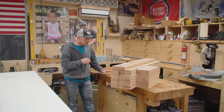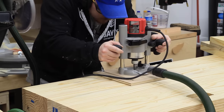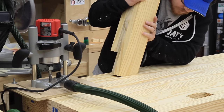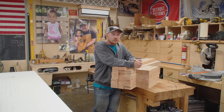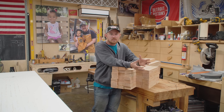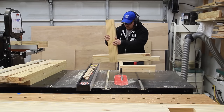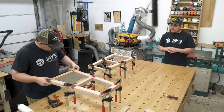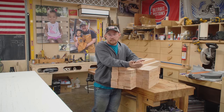This workbench I'm standing next to was built in 2016 — seven years ago. I went through the process of making a mortise and tenon joint from the legs to the bottom of the top, and I'm very happy with how that turned out. I did not want to do that eight more times for the rail-to-leg connections, so I used a massive half lap joint instead, which is plenty strong enough. Half lap joints are the very first real woodworking joint I started using after butt joints and pocket holes. They're very strong and pretty easy to create.